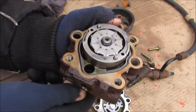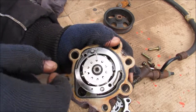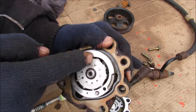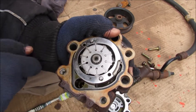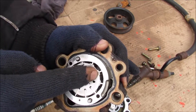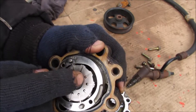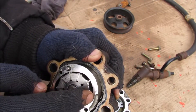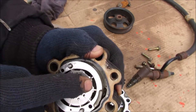Once fluid is inside this chamber you have your central shaft located in the middle, and then an eccentric cam shape on the outside that forms two pockets because of that shape. Inside you have the rotor with little vanes on it that can move in and out. While this is turning at engine RPM, centrifugal force causes these vanes to push out against the outside stator, forming these little pockets.